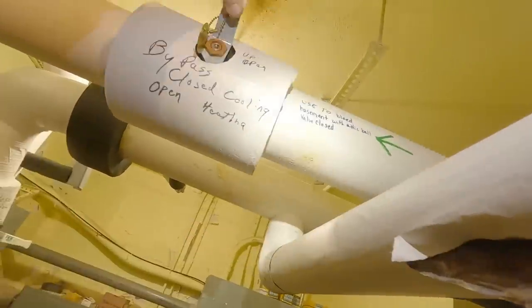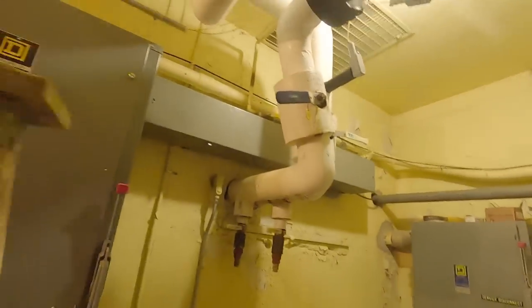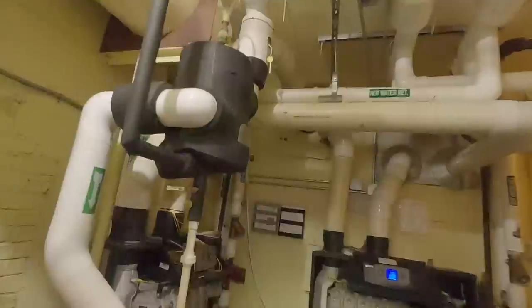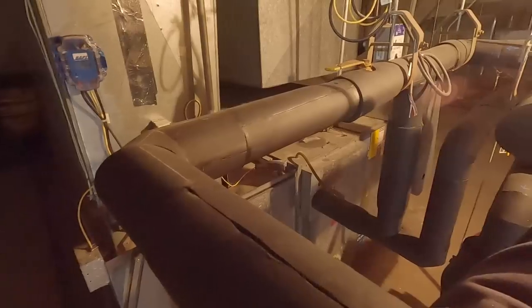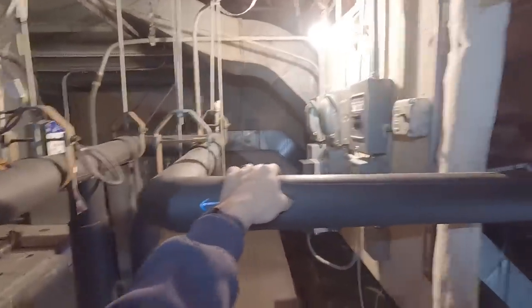Then usually you're good to go after that — for whatever reason, things just took a dive. We're getting some air there. I am warm — definitely warm, and it's looping its way around. So downstairs, air is taken care of. Hopefully upstairs is good because I stopped it coming out of the coil — any air should have been trapped in the coil and into the bleeder. We're going to go up there and do that real quick, open it back up, and see if everything runs. I just opened that valve coming out of the coil, and I'm waiting for this one to get warm — this is my incoming side. It's getting to the point where I do not want to leave my thumb on it. We're good there — it's come out at 84 degrees and rising. So it's cranking — that's why that water didn't feel very hot coming out of the coil, because it's going in the ductwork where it should be going.